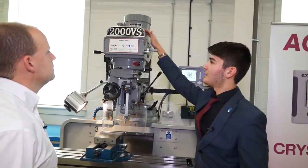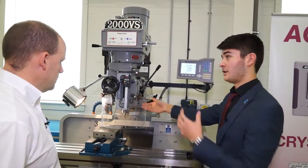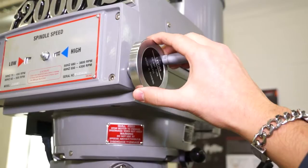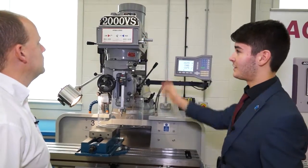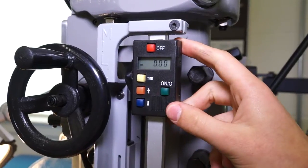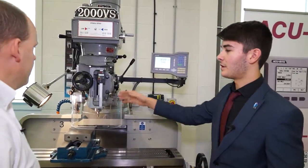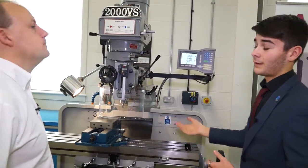To change the tool, you just get a wrench and undo the big bolt at the top, pull out the tool bit, put a new one in, and tighten up at the top. Moving down the machine, you change the speeds up here — just turn the handles and it will change to the speed you need. This gauge gives you precise accuracy so you can only drill down so far without going too far. If you want to go 3mm you can go 3mm; if you want to go 10mm it will cut off at 10mm.